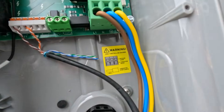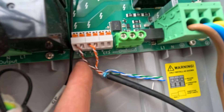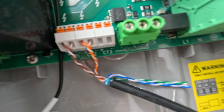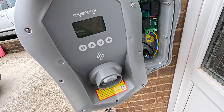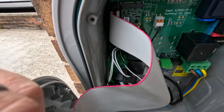That's all wired up. We've got our cables pushed into the little push terminals — it's got line, neutral, earth, and then the CTs. It's gone brown for positive, brown-white for negative, then orange for positive and orange-white for negative for CT2. Let's get this lid back on — it's got a little fly lead, just plug it in like that. Easy.